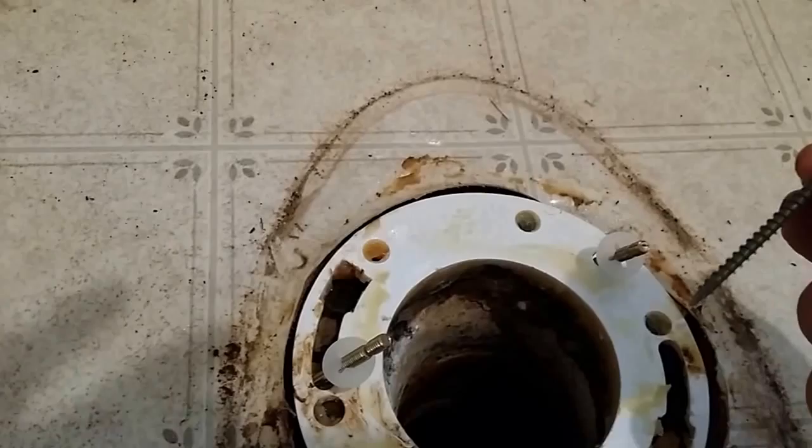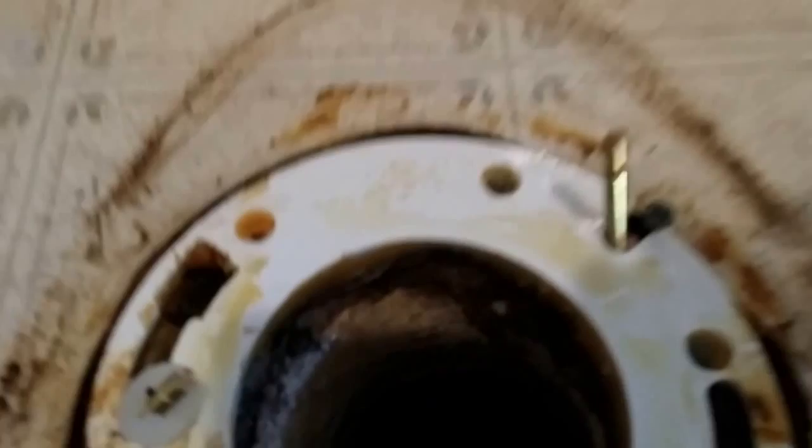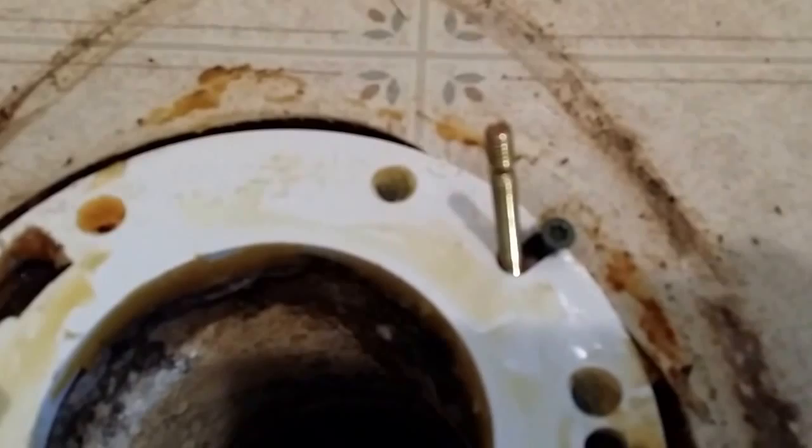So I'm going to show you what to do on that. Use a 3-inch deck screw here. So this is something of an example - you can see I was able to just drive the deck screw down beside the bolt itself there, thus stabilizing it. So now it won't rotate.